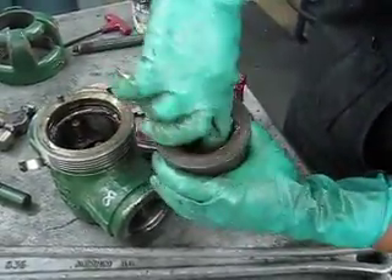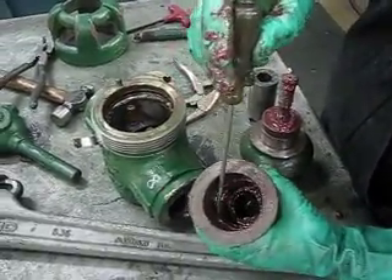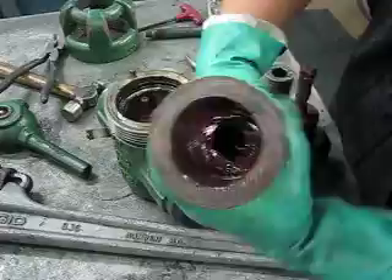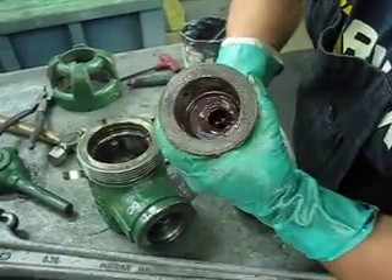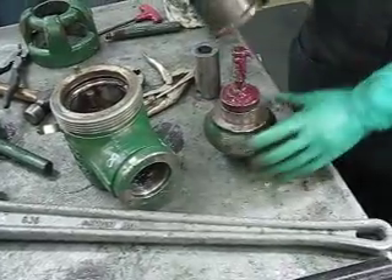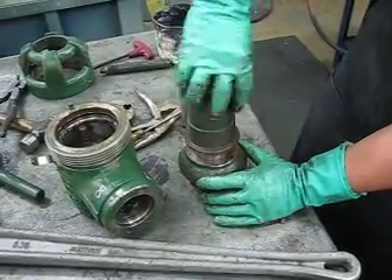This is where you've got to do your timing. See that first groove right there — that's where your stem screw has to be flush. So in order to do that, you go down with the stem screw until you get to that step. There you go, that's flushed. Next thing you want to do, just snap it on top of your stem and go counter clockwise about halfway.